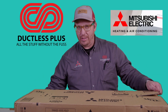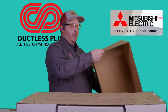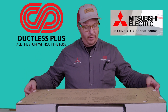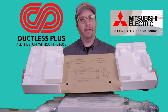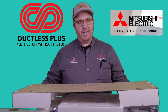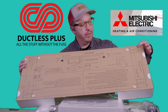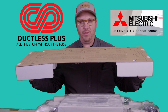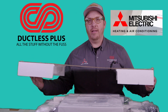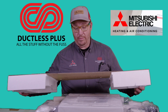The box is very similar to the MLZ KP-09 series — you're just going to lift it straight up. They've got the template here. It's very similar to our other MLZ installations where we build a 2x4 bridge and run the all-thread down to the feet. So that's exactly how this is going to get installed as well — you're going to use that same installation practice we've created doing the other installs on the other units.